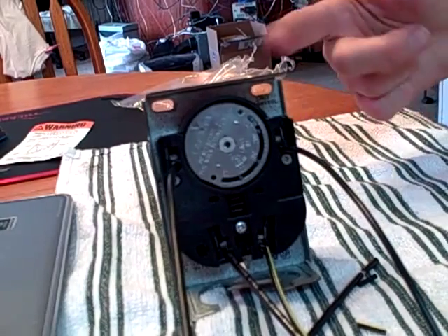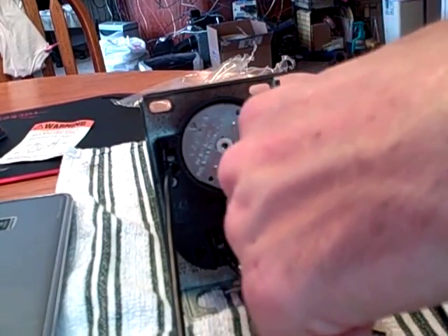I'm over there scanning the paperwork right now, and we'll look at it here in a second and give you an exact explanation on the center tabs. The schematic shows for the heater element or timer in the center: one wire comes off, goes over and attaches to common on the transformer, which also goes to the common side for the gas valve. The other terminal for the timer comes over and goes to the other side of the gas valve, which is also tied to W on the thermostat. So when you have a call for W, it is not only calling for the gas valve to come on — it is heating up this element here, which turns on the timer, which will turn the fan on sooner than if you had one of these that does not have a timer. Most don't have timers, but sometimes you run across them like this.